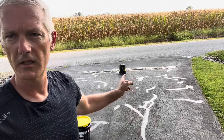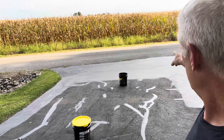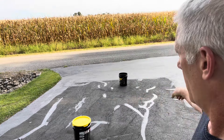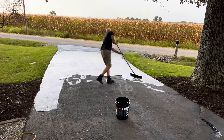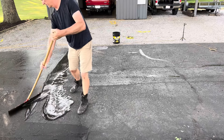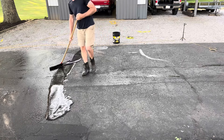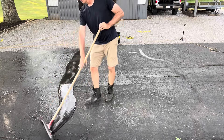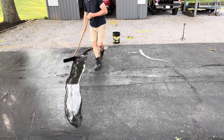When you dump out your bucket, put it upside down so the rest can drain out and you won't waste any. I do the edges along the grass first, then come back through and pull any excess down through the middle. I only pull about half the squeegee — that gets rid of the air bubbles and lays the sealer into the cracks. It's kind of like making a wave of water but with sealer, pushing out the air as it goes. It helps you get it down faster and smoother.